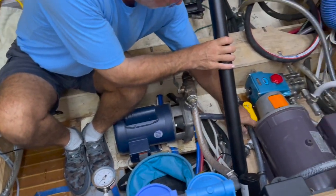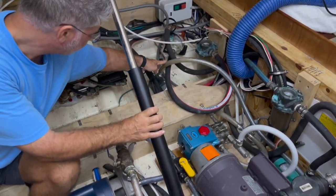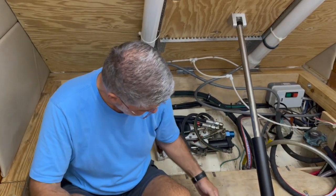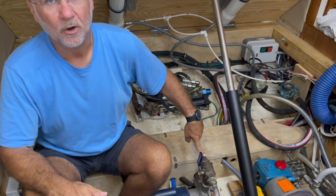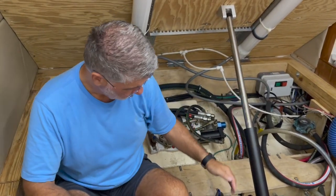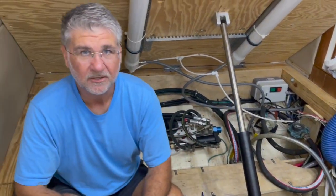What happens is the hose and sea strainer from the seacock has been stagnant for three weeks, so the water in there is going to be very, very smelly. I don't want to run that through my filters and through the membranes. So we're going to use the function of diverting this T-valve to the saltwater wash down on the bow. This will flush all of that smelly water overboard, then we'll divert it back. I will disconnect this hose and then we'll use that to pickle the system.